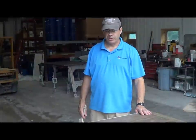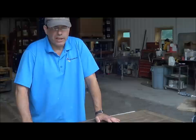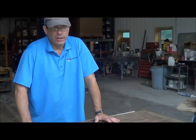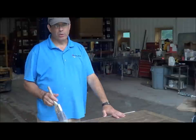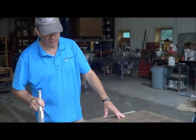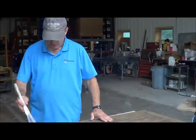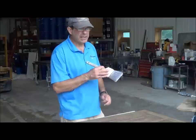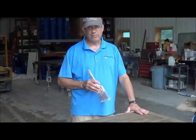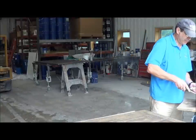It's been about an hour since we applied our stains and now we can seal it. We're going to use Trinic Stamp Shield — it's a high-quality, low-build, solvent-based acrylic with a silane component. That means it has excellent grip and it breathes. If you don't over-apply, it remains breathable, which is why we can seal the day that we cast. You can roll it, or for deep grooves you may want to brush it so it gets into them. I'm diluting it about 25% with xylene because this concrete is so dense.